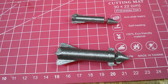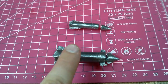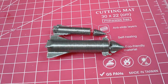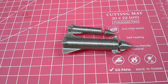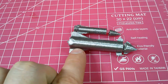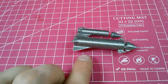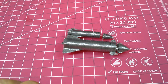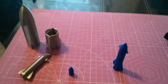In my print jobs I keep getting artifacts like this, pretty much in the same spot in the model even though I scaled it up, so I'm not sure what's happening. It sounds like the extruder is skipping while it's printing, but I hear it skipping even when it's on the start of the print, way down here. I don't know what's going on or how to troubleshoot that, after unsuccessfully printing this small model and this larger model with the filament jamming every so often.